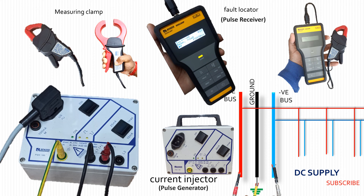If there is no DC fault at any terminal point or feeder, it will not create any closed loop and the pulse will not be detected by the receiver unit. The yellow LED of the receiver unit will blink slower with a distorted buzzer sound. In another case, if any earth fault is sensed by the locator, it will create a closed loop through the earth and the receiver unit will detect the pulse.